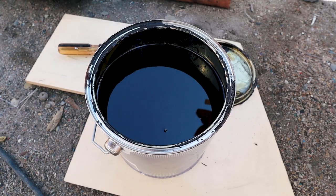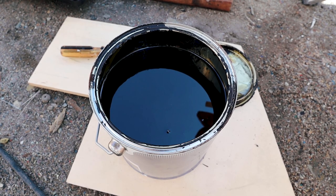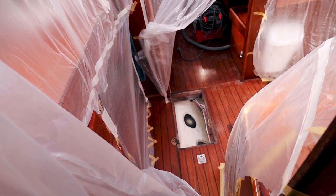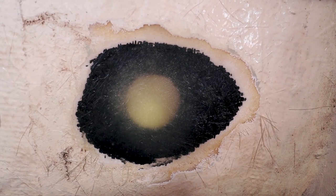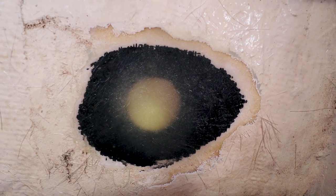After the epoxy sealant layer, it's basically ready to apply the antifouling — and then you're done. On the inside, it's the same process, building up the fiberglass resin layers. To make it look pretty, the inside got painted with bilge paint. You don't need the osmosis treatment on the inside, obviously — as long as your bilge is always dry, which is what you should aim for.